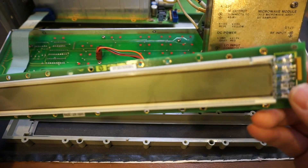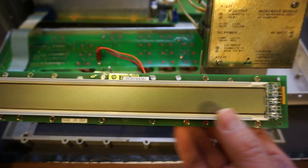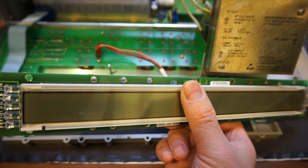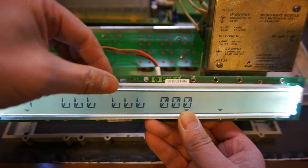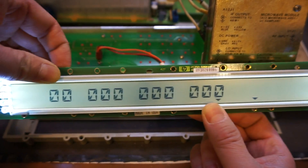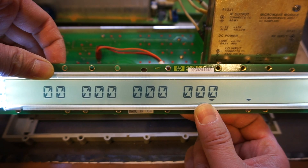That was not the easiest thing to replace — these are freestanding and it took a lot of time to align them properly. I could probably spend a little more time to make them even better aligned, but I think it'll do the job. Let's power it up and see if it makes any difference. I think it will, because white LEDs are very efficient and should be much brighter. Let's turn it on — oh, look at that! Wow, this is clearly a big improvement. The LCD contact issue will go away once I put the frame back on with pressure.